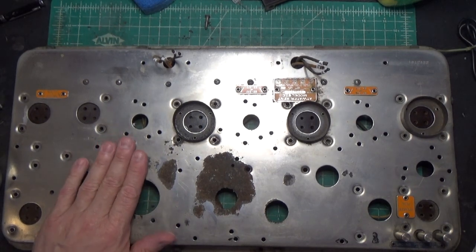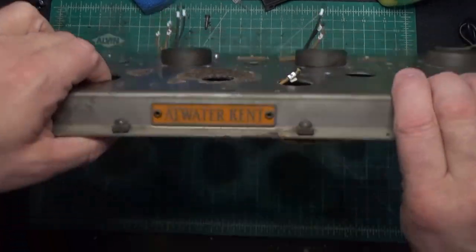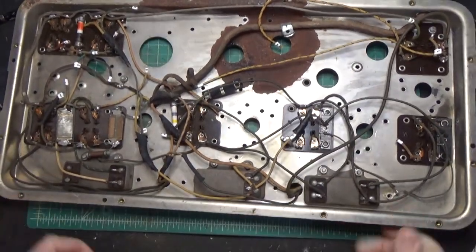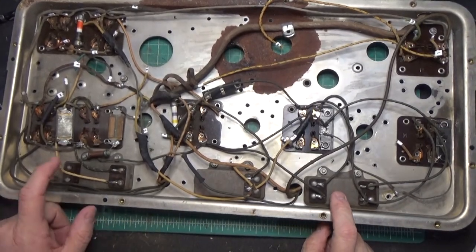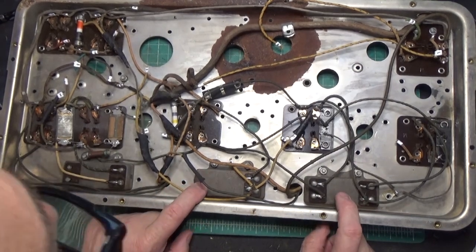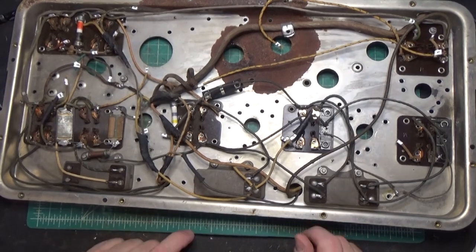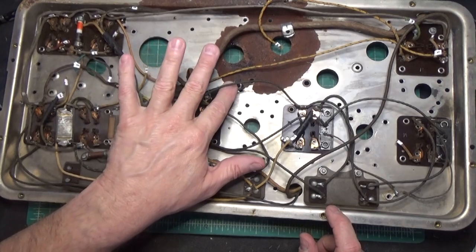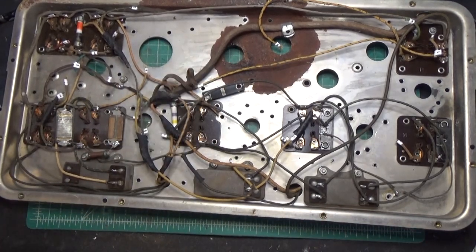I think what I'm going to start doing under here, and this will be in the next video, is starting to replace some of these capacitors. And the capacitors on this thing are in the sardine cans here. I think they're mostly point ones. I have to see if I can figure out what they are, but we're going to drop these cans. It shouldn't be so hard, and we're going to restuff them. So we're going to put the cans back the way they are. We'll clean them up a little bit. So we'll start that, and then we'll begin the process of rewiring all of our coils back together.